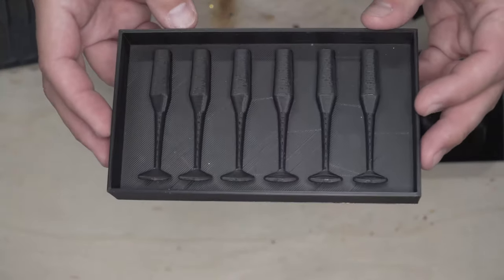The big reason is the material these machines print in. With FDM printers you're going to be using materials like PLA, PETG, maybe ABS. The key point for fishing lures, more specifically molds, is the heat deflection temperature of these materials is really low. ABS has one of the higher heat deflection temperatures and it's around 220 degrees Fahrenheit. Heat deflection is when the material gets heated to a certain point and you apply pressure — is it going to deform or change shape?